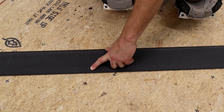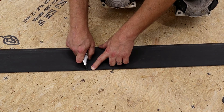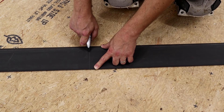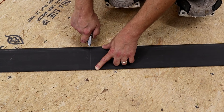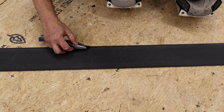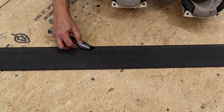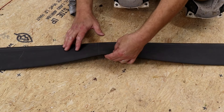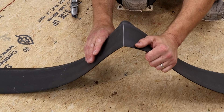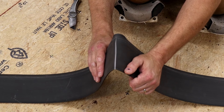So I'm going to take the line I etched on the back for the corner and put a scratch on the back of it, being sure not to cut all the way through — only cutting partially through. I want to stop right as the cove base starts to bevel down. You do not want to cut into that bevel. Stop your cut just as it starts to bevel, then simply fold it back, and you can see the bend creates a little trench or valley in it.